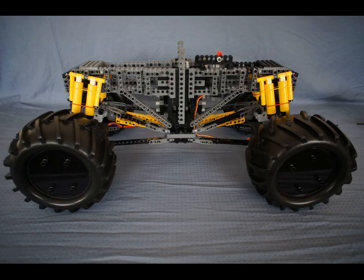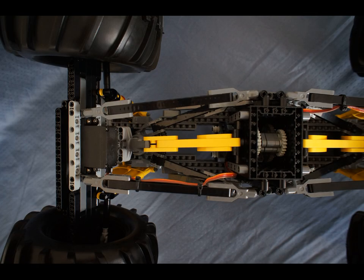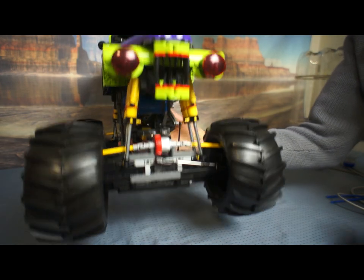Here's an early version of the chassis — just trying to get the geometry correct with the initial gearbox, but nothing else fitted. And experimenting with cross-bracing to get those nice Euclidean triangles. Here's the underside of the tie bars that make four triangles, which allow the suspension to move up and down one wheel at a time, but not go sideways.